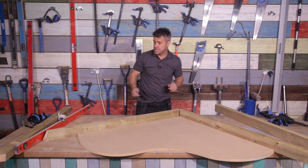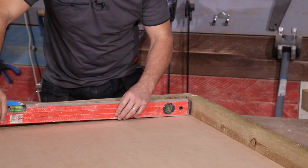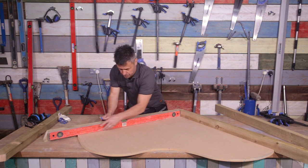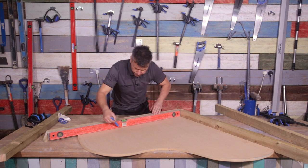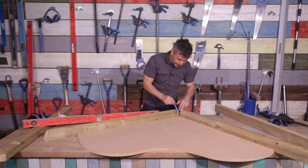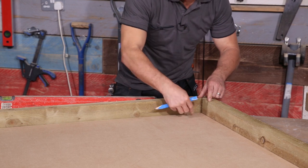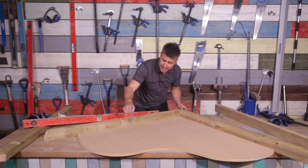The trick around that is quite simple. Get yourself a straight edge — could be a spirit level, could be a batten of wood — and place this on top over the gap but flush with the edge of your wall, whether it's plasterwork, painted, or wallpapered. Butt up along that edge, take your pencil, and draw along here. When you remove that, you'll see that the pencil line is now chamfering away. Once you cut along that line using your circular saw, it will fit completely snug against your wall and it'll look as perfect as that.